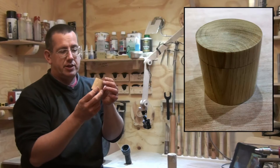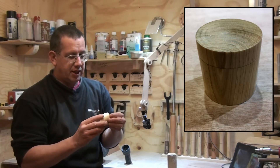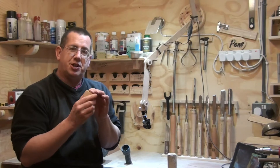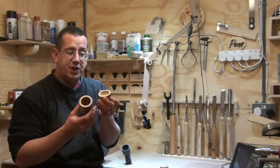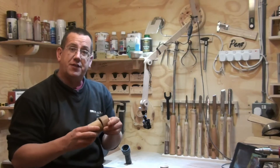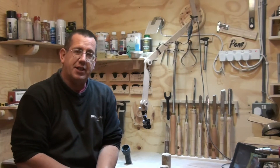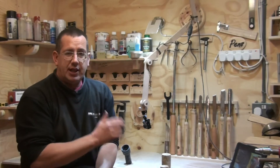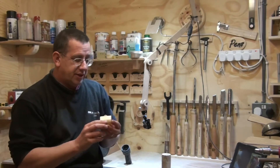For part three I decided I would do a finish turning on a rough turning, and I produced this lovely little box. I've got to say I'm over the moon with this one — this is the first piece of oak I've had with such a smooth finish, it's unbelievable. I started off with a rough-turned piece very similar to this in size. It had been sat here in the workshop for about four to six weeks, and this morning I ran it through the microwave a few times, 10–15 seconds at a time. It only lost about another two or three grams, but overall it had lost a good 25% of its weight. I then put it on the lathe, finished it off, sanded to 600, applied sanding sealer and Wood Wax 22.